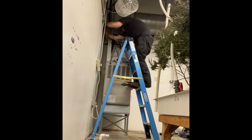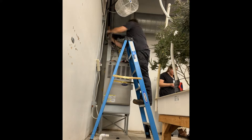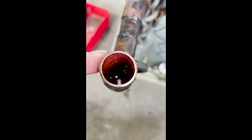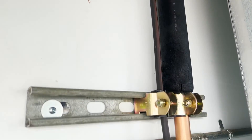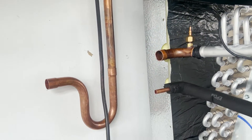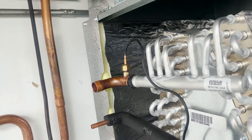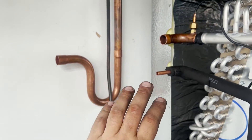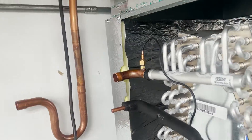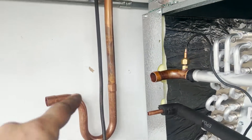So here's what the reference shows: when all your oil is in the coil, it's time to add a trap to this system. We just got our line set supported on the wall now with some cushioned clamps. We're gonna tighten those down once the positions are final. We're working on how to get a trap in here. It's optional with this configuration, but these units trap so much oil being below the units the way they are. So we're putting in the optional oil traps just to make sure that oil is not logging up this evaporator. But I think we're gonna have to shorten this up and do some sort of U-turn into the unit.